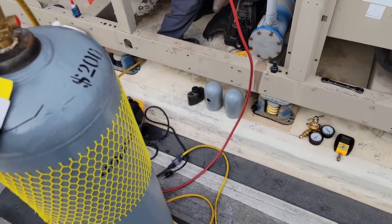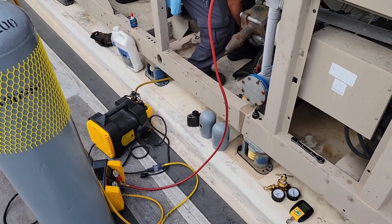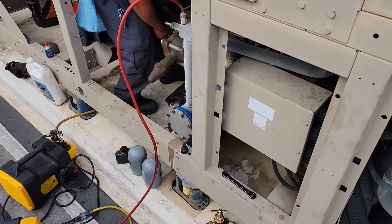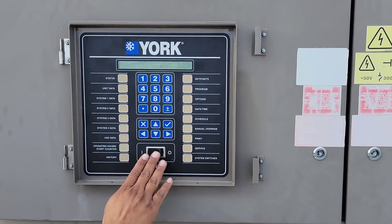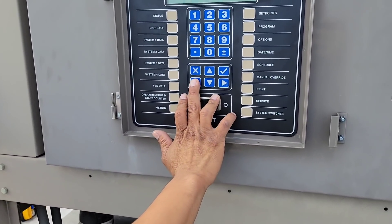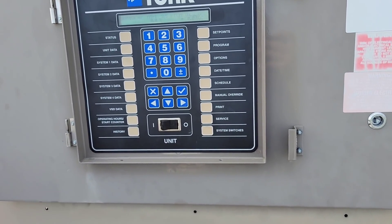The Appion 8 did its job — now we are rolling with the charging. We've got roughly right at 230 pounds here. It'll take a little over an hour; I'd say within about an hour and a half we'll be done with the charge and ready for startup. So this is 105, and then we've got 20 in there. Go ahead and toggle it down, shut it off. You'll go back into service mode, then you're going to cycle back over to the analog outputs, the AOs, and you want to cycle both of those valves, key in 100 percent and enter.